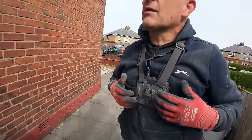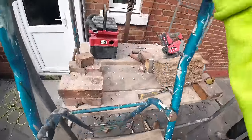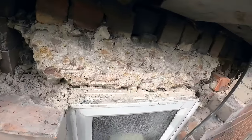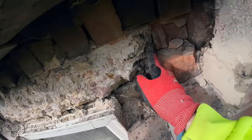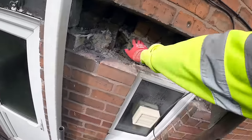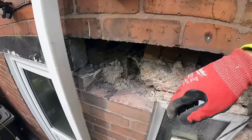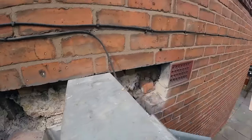Yeah. Just show them the lintel now where I've cut it back and show how bad the concrete is that they used. Sure, this is scrap sandstone. Oh, look at that. I think this side he just managed to get it off with a brick hammer. But there you go, so that's your knocked back. Hopefully it's enough. I've checked. We've moved as many bricks back as we could as well. But these ones, the header's going in that way, so we don't want to interfere with that in case he knocks any plaster off.